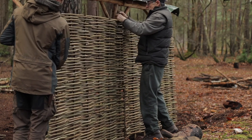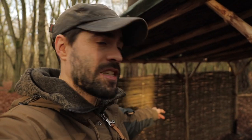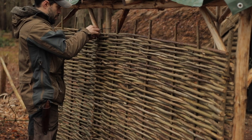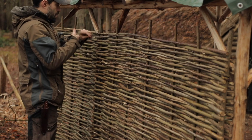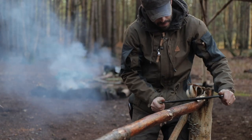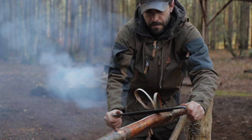Well, it's primitive, really. It goes back probably thousands of years, but it's certainly here in England a very old traditional technique of building a hazel hurdle or wattle wall. And it involves using green hazel. You can use willow as well, and sometimes birch. And green because it's obviously got the sap in it, it's bendy. And you can weave it in and out of vertical stakes, and it makes a really rigid, solid wall. It's fairly tricky, but more time consuming and labor intensive, but the end result is absolutely incredible. So if you'd like to see that video, I'll put a link in the description.